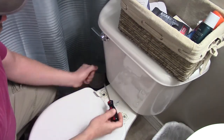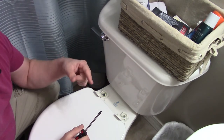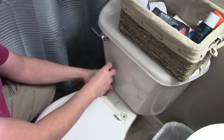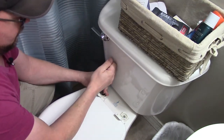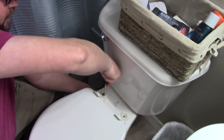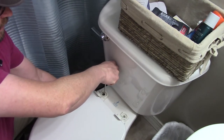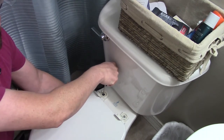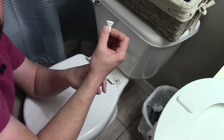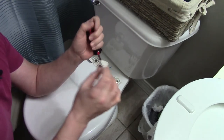Let's move forward and get rid of this old stinky thing. A lot of toilet seats just use a straight screwdriver up top. They may have a little winged nut on the bottom to hold onto. Most of the time, it's long enough where it actually catches the side of the toilet. So you may spin it first, but then it should catch the side of the toilet and lock against it so you can unscrew it. This one here doesn't have that winged nut — it feels more like it's going to be similar to the one I've got going on. Let's take a look real quick. So it's a little socket on this one. I just did the second one by hand because it's a similar design to the new one, but it's not the same size — I don't have the socket down here, I have to go all the way out to the garage. So just take it off.